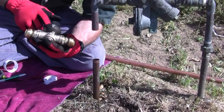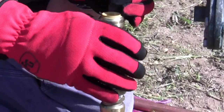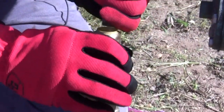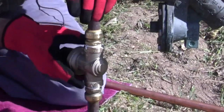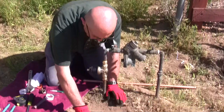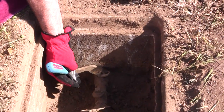I'm going to look at the arrow on the valve body — coming from the meter up — and follow that arrow. I'm going to push-fit the bottom fitting, making sure it goes down the full inch. Then I'll pick this up and push it down a full inch on the top — there's the arrow going up — and that's all there is to it if you pay attention. Now to check for leaks and adjust the pressure, I'm going to turn this valve on slowly, because that's the right thing to do to prevent blowouts and surges.